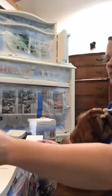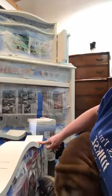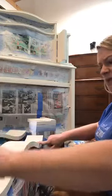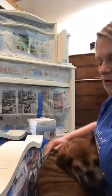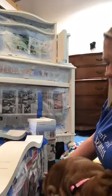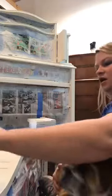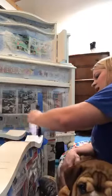There are really two different kinds of sealers you can use — a urethane-based sealer or a polycrylic instead of a polyurethane. The urethanes will really yellow over time, especially on lighter colored paints like whites and light colors. You don't really want to use those on them because you will see very quickly that it will yellow and change color on you.